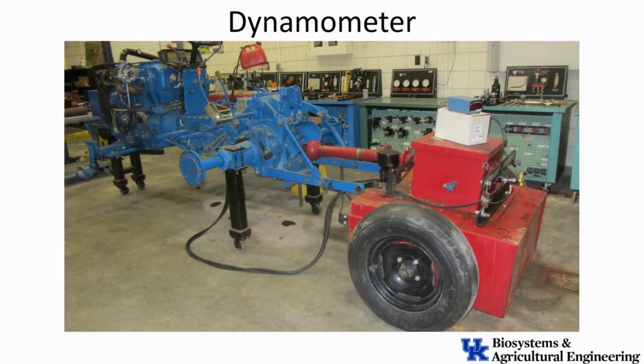All right. Let me talk a little bit about that power takeoff shaft and that power takeoff that comes out of the tractor. Again, this is actually a standard, and we'll talk a lot more about standards later in the semester. But there are standards that dictate what that shaft should look like and how fast it should turn. So this gives us some commonality when I have a tractor designer who designs a tractor and another manufacturer that designs an implement that I want to put on that tractor. They can develop something, and they know it's going to connect up and it's going to work.